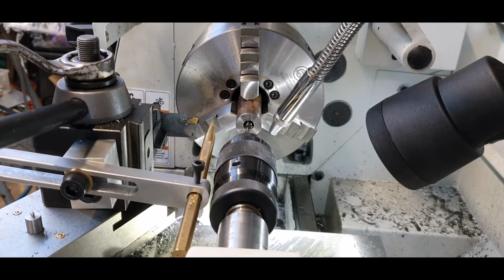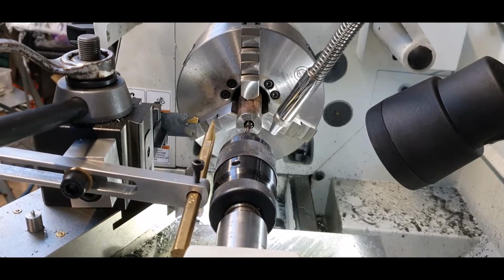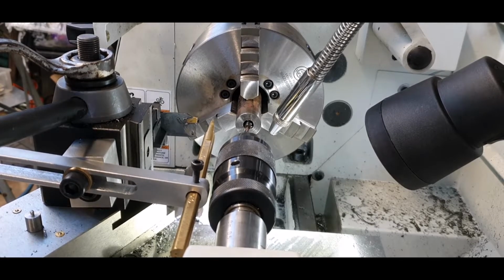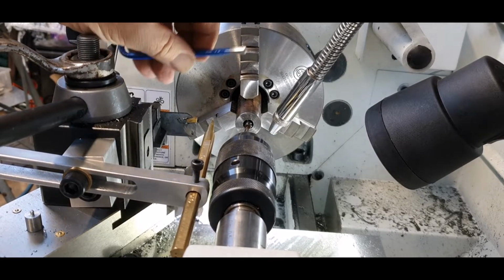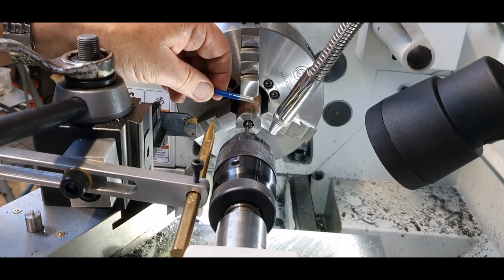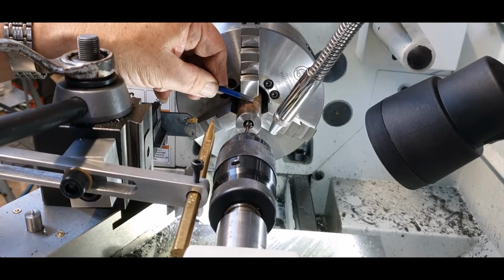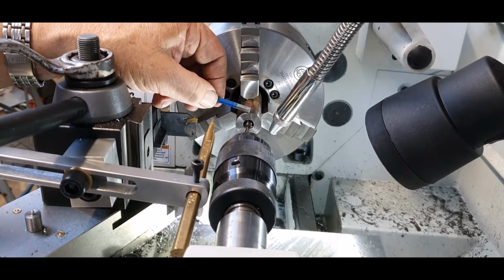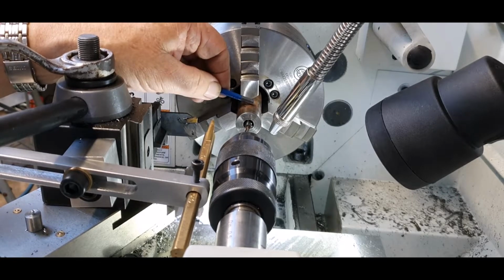Alright, what I have to do here is, because I've made the two 29.5mm bushes, I have to make another two 7mm ones, which go underneath the sprocket, this is the drive and the idler, or the tensioner, because it has to lift up the sprocket to suit the alignment of the main driven one. If that makes sense, yeah. So because I've just pulled that out, I'm going to drill a hole probably about 30 mil in here, and then I'll take that out and put the 10 mil back in here, and then I'll cut off two 7 mil sections.